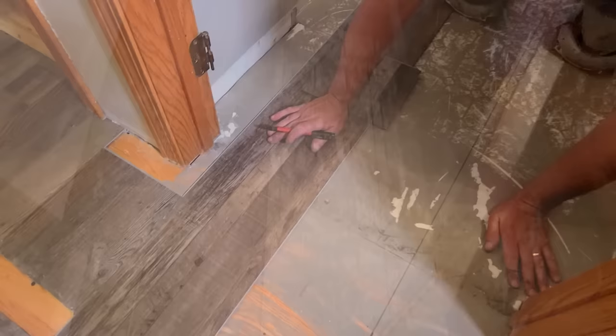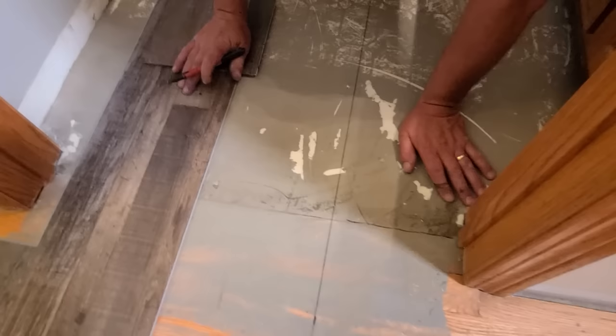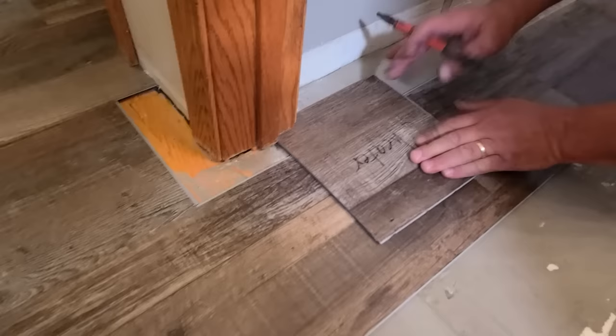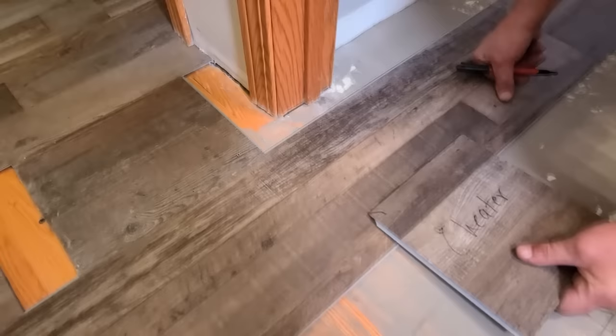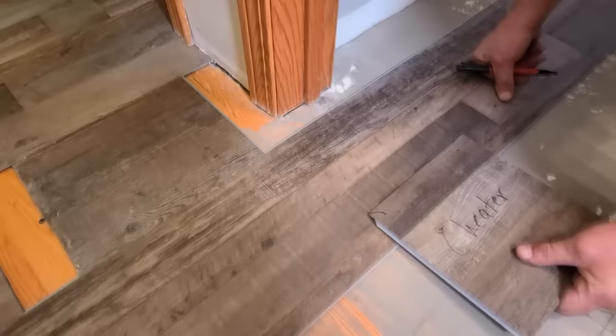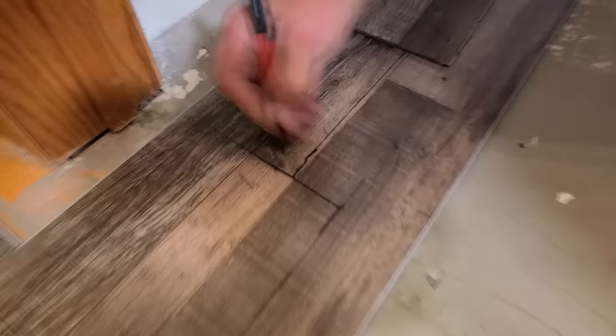Working away from a jamb is a lot easier than working into a jamb. I always try not to have a joint anywhere in the doorway until I get to the end, so I can actually end up having the joint right here at the end to make it easy to get these pieces in. Now to slide my cheater board under, I'll make some marks. It gets a little difficult around these areas because it's hard to slide it under, but if you just make a couple of marks you can connect the dots. I'm going to start going down this wall, coming in about a quarter inch and making a mark right there because I know that's going to go under the jamb.